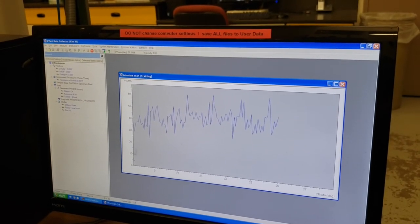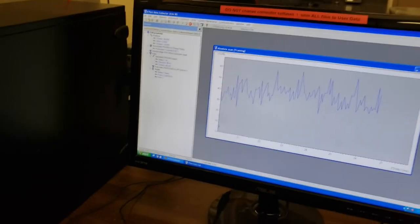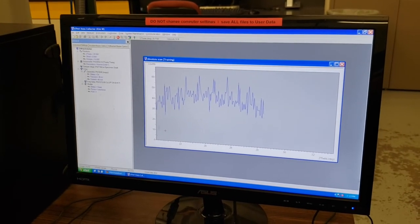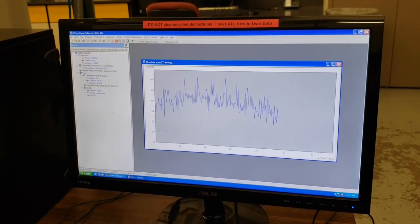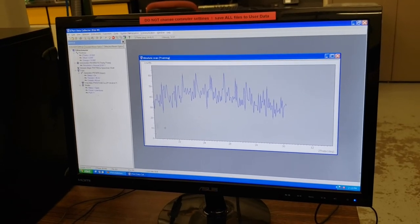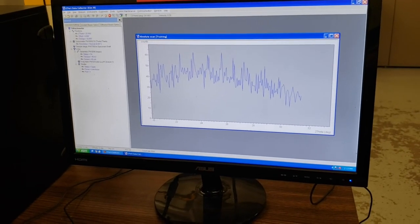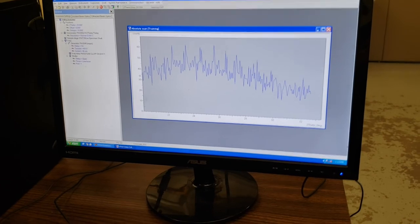This will show approximately live time the data that it is collecting. Our counts right now are at 40. You can see this looks really noisy because we have a very short or very small y-axis. As this gets peaks, the counts will change and the y-axis will stretch out accordingly. If this noise is originally between 5 and 0 counts, that is typically problematic. If you are seeing counts between 5 and 0, that means the detector is not getting x-rays. Part of that can be because your slits are put in improperly, meaning they are blocking the x-rays coming through. It could also mean that your sample is too rough or is not aligned properly, meaning the x-rays are not diffracting properly and making it back to the detector. If you need help troubleshooting, feel free to reach out to one of the staff.